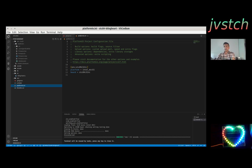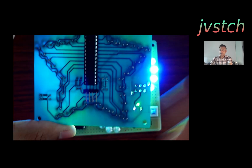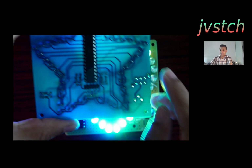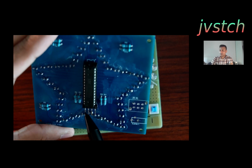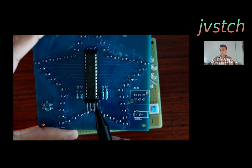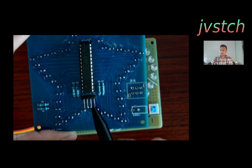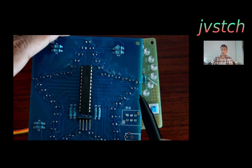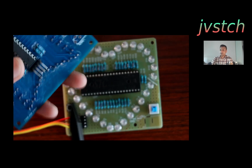So this STC Micro board came up with, as you can see, the RX, TX, the ground, VCC. So it already came with a header, so you can just solder this header, connect, and start developing. It also has the provision for the barrel jack and the switch, which I didn't use. I just directly connected power.